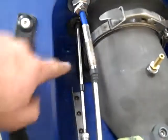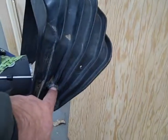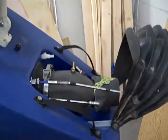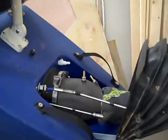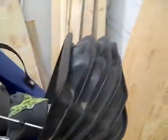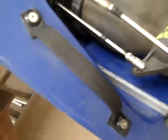I also have to plug a hole that's down here — I started with this down below but the geometry is wrong. You have to go straight into the up position, and you can see it's still a little bit down. You need to be virtually straight. It just happened that this was the factory pivot point for the Sea-Doo, and I put one here and one here and one down there playing with different geometry. I found that this height is about right — the leverage is just right. So if you need to hang something off there, remember you've got to go straight and then pivot — you can't be solid. I'm happy with it. The steering is smooth; you can move it by hand with no problem at all, and the same with my foot steering — nice and smooth, no slop.